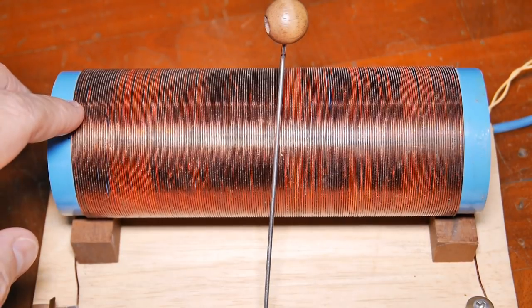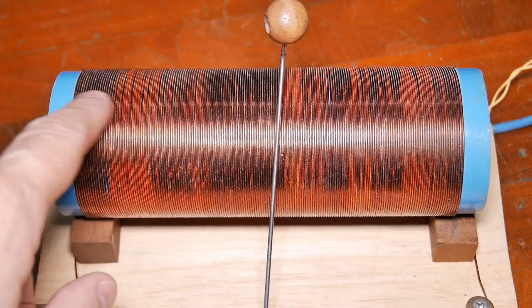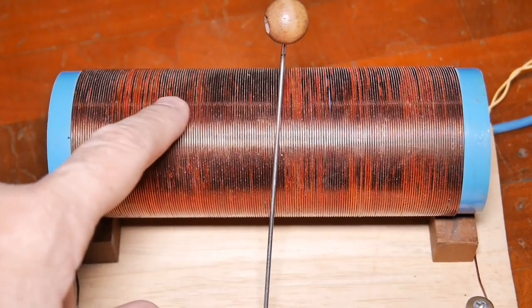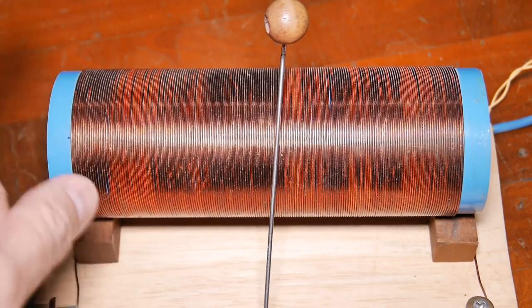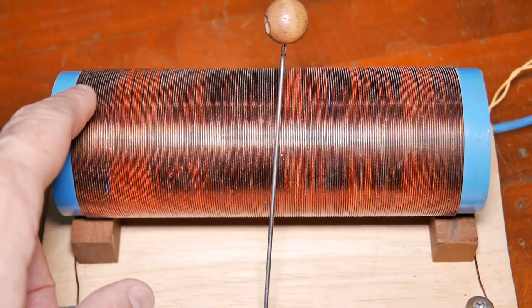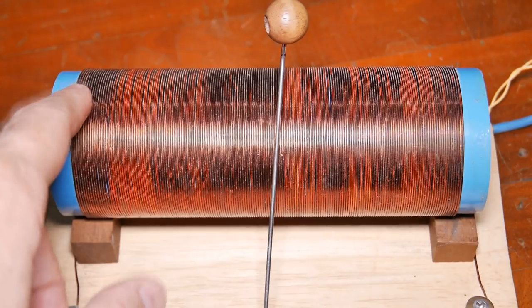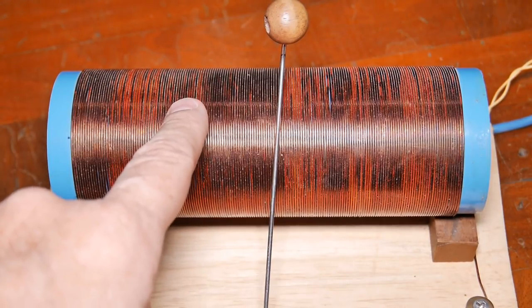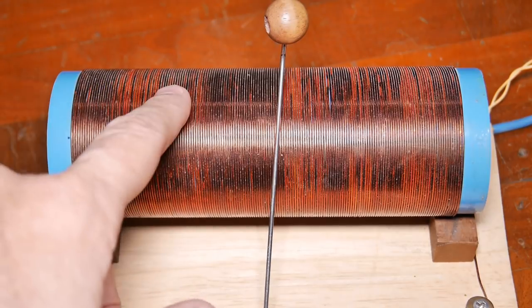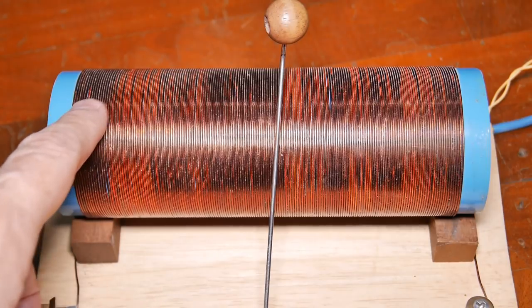If the wire is too thick or too thin, you will get too many or too few turns per distance. So a lot of times this will be like, you know, 5 turns per inch or 10 turns per inch or 5 turns per centimeter, whatever it is. The thickness of the wire affects the number of turns per distance, and that will definitely affect how well your radio works, and it may put you off in a different band where there's no AM once again.